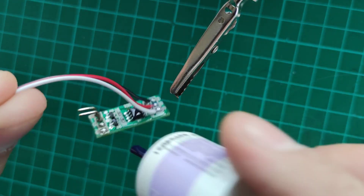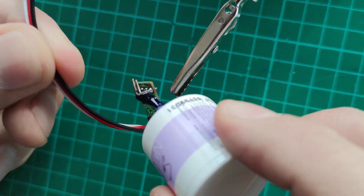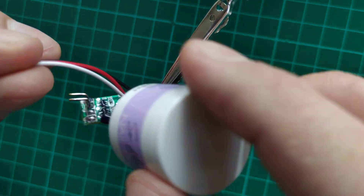More is better in this case. Just remember two things. First, clean the PCB before you start painting. And second, do not cover the whole pins, because we still need to attach the plug.